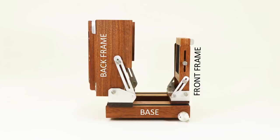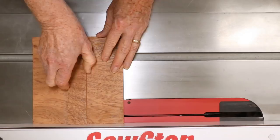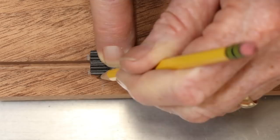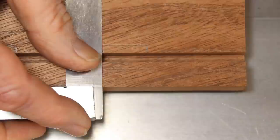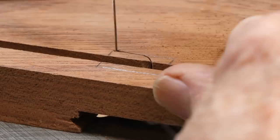You're looking at the base right here. I need to cut a slot for the focusing shaft before other parts start to get in the way. I will mount two small pinion gears on this shaft. They will engage with two rack gears located directly above them. I cut out holes that will allow free movement of these pinion gears using my scroll saw. It actually took me much longer to be sure I was cutting in exactly the right spot than it did to actually cut the holes.